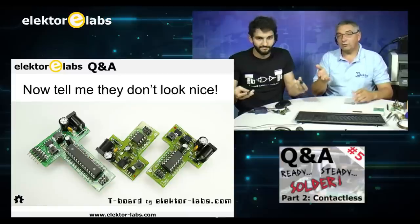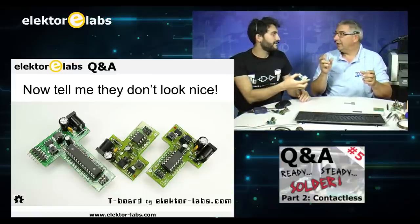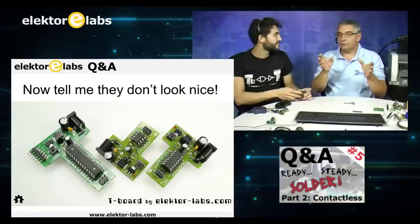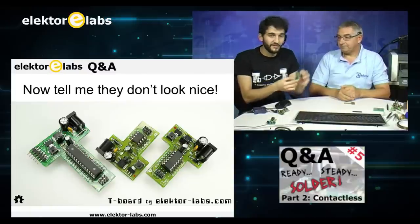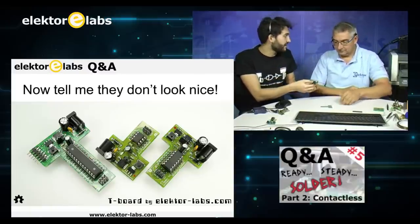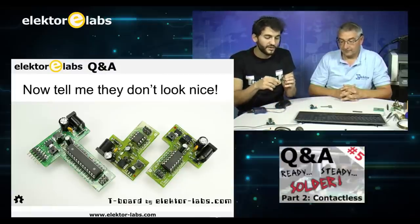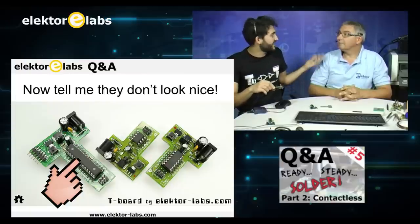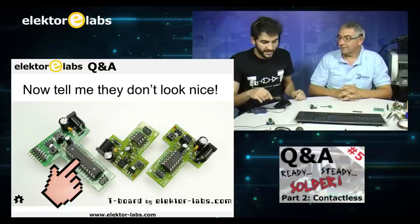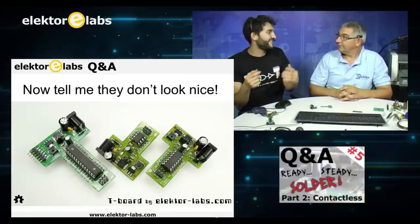Because that's the downside when you use an Arduino or a BeagleBone, it's even bigger. They're a very nice product, but sometimes you only need a small microcontroller, a DIP 8 or something. And then you put your program in, and it's just steering a few LEDs. Why use a bigger microcontroller, which is massive? So for that reason, you would go with something like this, which is an 8-pin microcontroller. They're all Atmel stuff. And the bigger T-board has this extremely famous ATmega 328, the same as you may find in the Arduino Uno.